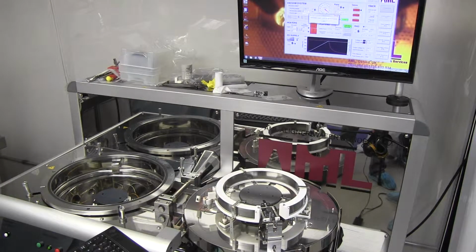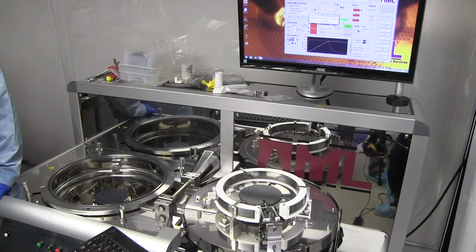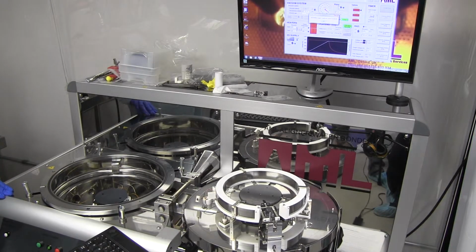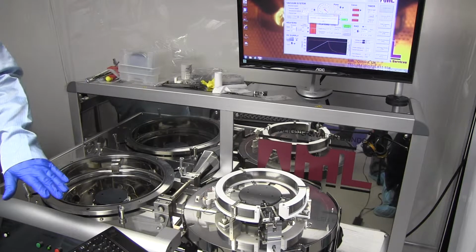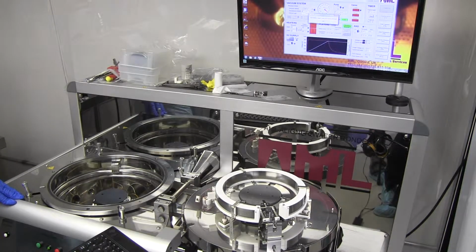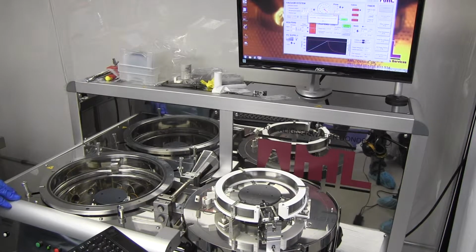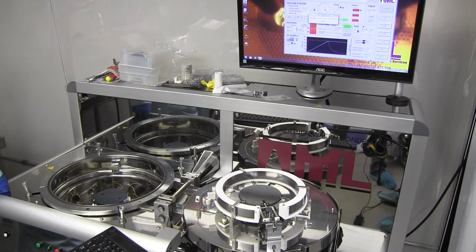I mean, in theory, if you have a really thoroughly activated surface, there's a chance that you may have some slow reactions happening at room temperature, and over 4 days, perhaps you get some bonds forming, but I think that would probably still be quite a weak bond after that time. And you need some heat to overcome the activation barrier. As far as I know, this plasma activation reduces the activation barrier, so it reduces the annealing temperature from 1,000 down to sort of hundreds of degrees. As far as I know, it's not efficient enough to do room temperature direct bonding. I know room temperature direct bonding is kind of the holy grail of the bonding world, and I don't believe we've cracked it yet, and I don't believe anyone else has either. It's kind of a dream for everyone. So, yeah, maybe you'll get a weakish bond by just leaving it over a few days.